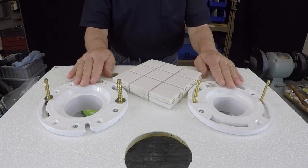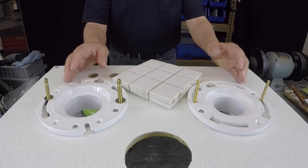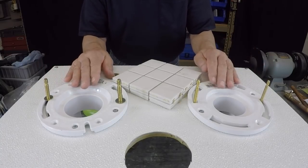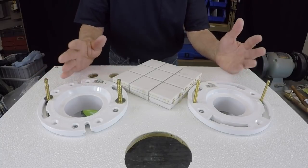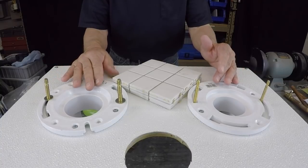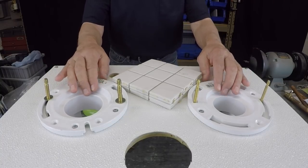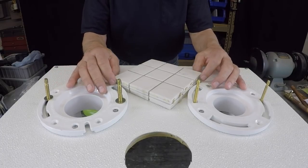And, you know, there's 2 ways to do that. You either make a major plumbing job out of it and you open up the floor to raise the flange if you have to, depending upon what the material is. Now, if it's PVC, it's going to be a little more difficult. If it's lead pipe, a little easier. But, you know, lead is what happens here in New York City. In most parts of the country, it's PVC, it's ABS. Sometimes it's even cast iron. And you can get extended flanges, you know, with long horns on them, and they're relatively easy to change.